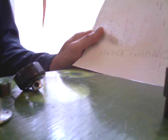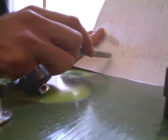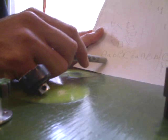Because this is a 12-teeth, 14-pole motor, you wind it based on the way that gobrushless.com tutorial states. It's still based on the phases A, B, and C — but capital A means clockwise and lowercase A means counterclockwise.